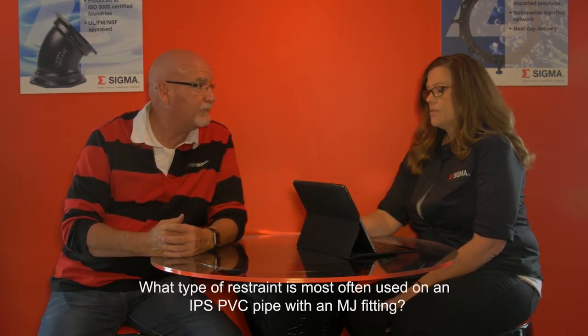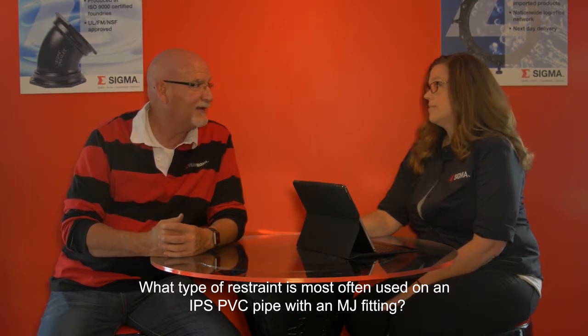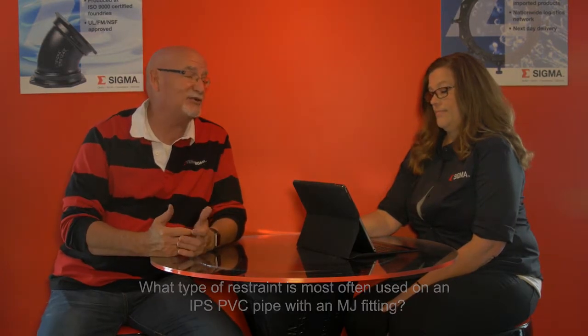What type of restraint is most often used on an IPS PVC pipe with an MJ fitting? Okay, that's a good question, but I've got to ask you a question first. What does IPS mean? Iron pipe size? It does mean iron pipe size. The difference between iron pipe size and PVC C900 or C909 is that iron pipe size has the same OD as steel pipe, and C900 and C909 have the same OD as ductile iron.